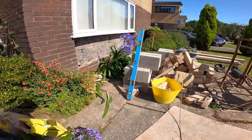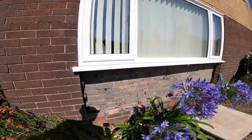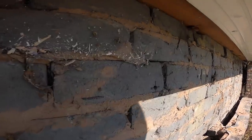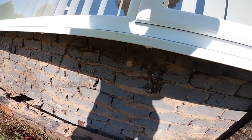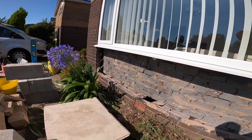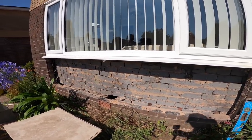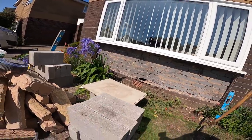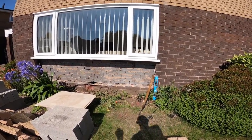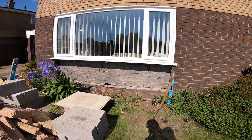And then I'm all set up on the front. Same again. Gauge marked, line marked. And then I've got two ties drilled out. One, two. Four brick tie. And we're going to just bend our frame ties for that. And I'm going to make sure that they're running down as well, because I can't be doing with the abuse.